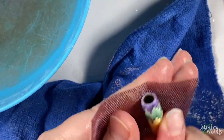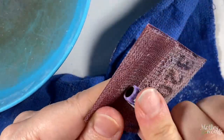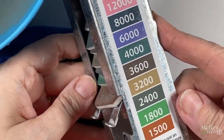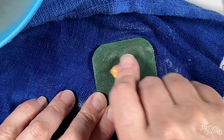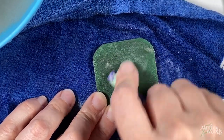Next, use 400 grit sandpaper to smooth the finish further. Don't forget to give as much sanding attention to your sloped ends as you do to the rest of the barrel so they don't have visible scratches. You can stop sanding at this point and assemble your pen, or you can go on to use micromesh and also CA glue. When I work on a lathe, I don't use any micromesh before applying my CA. I assumed my hand sanding probably wasn't as good, so I decided to do the first two micromesh pads before applying my CA.